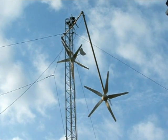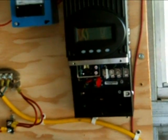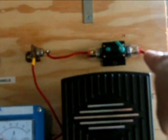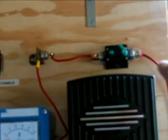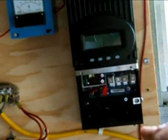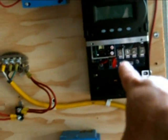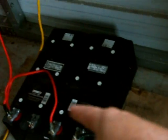That's going to be a project in the next month or so. For right now I'm just going to finish my solar panels and some other stuff. I might as well go ahead and finish this now — I got my Outback charge controller here. I'm going to bring the wires from my solar panels through a breaker and a diode, bringing 80 volts in. I've got 28 panels, so I'm going to do strings of four — that gives me exactly 28 — and then from there go down to the new bank of batteries I'm making.